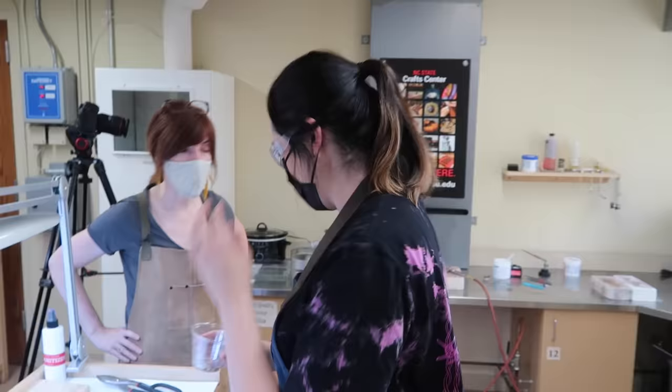I just wanted one more shot at it, just so I could try and get the pour right. I'm ready for the peas. For this pour, we had taken a bunch of our cut-up bracelet bits — that's a little sizzle-tastic. But after a bunch of blasting, there were some pieces in there that were just not melting, which led us to believe that there may have been some mystery metal in there. We're not sure if all of that was fully plated or fully sterling. So Sarah fished them out and we added a couple of extra pieces back into the crucible to make up the volume. I think I did a bit better with a controlled straight line pour.